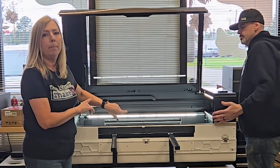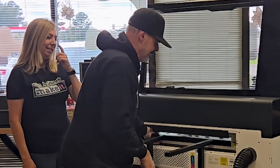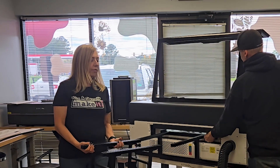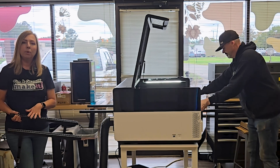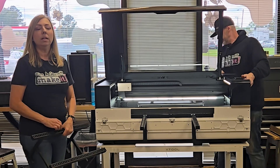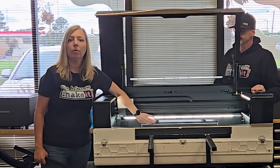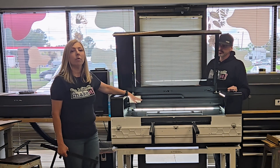I'm going to do the same thing with two rails on the back side. This is also magnetized, so the pass-through system is already installed in the back — just tighten those knobs down and you're ready to go. Because we're using a full eight-foot sheet of MDF, we're going to use our expansion rails. This will sit on the front and the back to give a smooth surface; the wheels roll really easily so the board is supported at both ends. A great thing about this new conveyor system is that you don't need a ton of extra material on either end. With the P2 pass-through you had to have about 12 inches on either end; now you really only need four inches at the front so it has enough room to grab it. I really don't need extra room for the end cuts — just the four inches in the front and it's good.